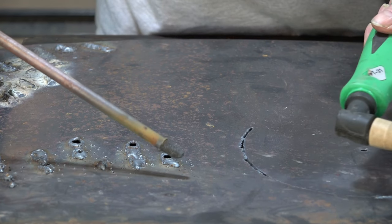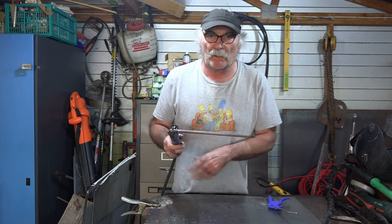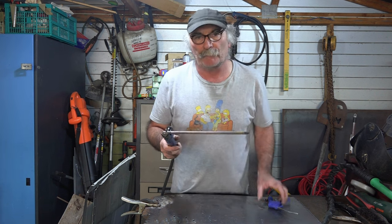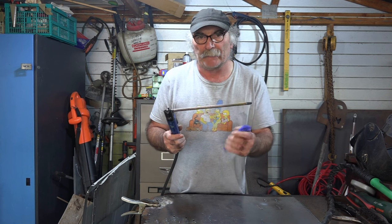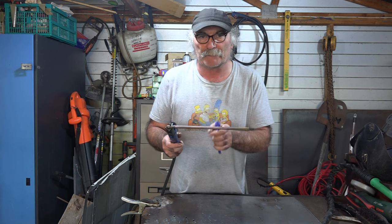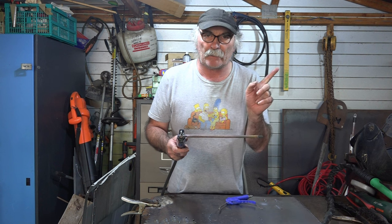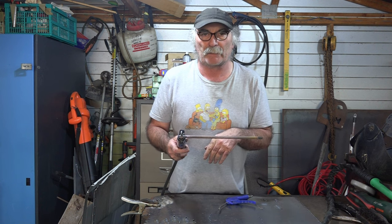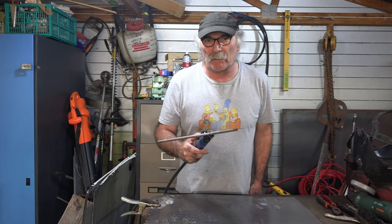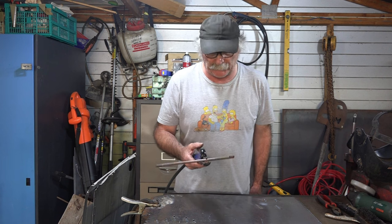Now, because these torches are quite expensive, I've made my own DIY one. It's got to be better with a professional torch, I would think so anyway, but I just made mine up myself out of an old electrode holder and an air gun. I reckon that'll work just the same. I'm not even running this on an arc welder — I'm running it on a MIG welder. If you want to see how I've hooked this up to my MIG welder, check up there and I'll put a video link. Anyway, this is basically just a stick of carbon — or graphite, or whatever you want to call it — I think it's one and the same, but someone will tell me in the comments below no doubt.